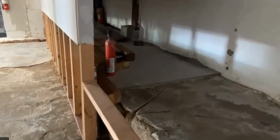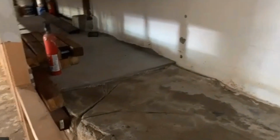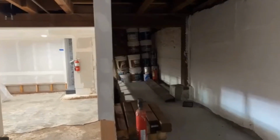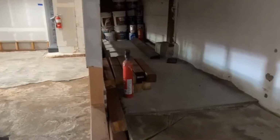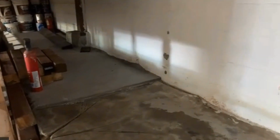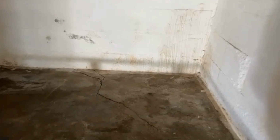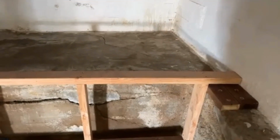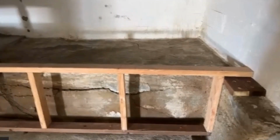Basically, there's two exterior walls, and you could call this a crawl space. Even though it doesn't look like a crawl space, this is common. Where a crawl space and a basement come together, this is what happens. You've got water trapped between two walls, and the only way to really remove that is to dig down to the footer and put the system in, pump, lift it up and out. Hopefully that made sense. And I'll make a still, we'll freeze the video.